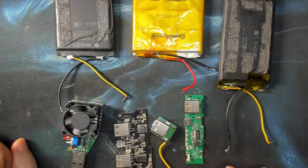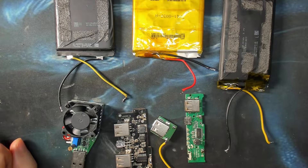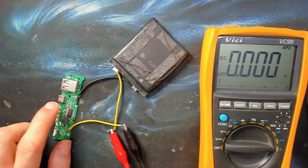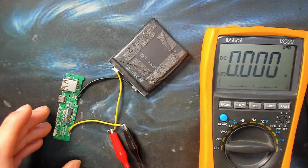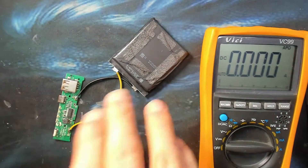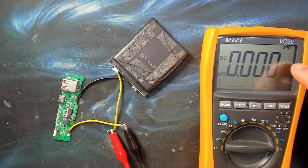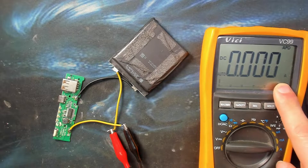This is interesting because it tells you about how long power banks can hold power, and how some of them will just drain their battery with nothing connected, but some don't. I've got a decent power bank controller board here which I'm planning to use in an upcoming project. I selected this one because I wanted to find the one with a very low quiescent current or a very good standby mode. Notice the whole thing is in complete shutoff - it's all connected but in shutoff, and there is zero current being drawn from the battery. We're looking at milliamps here and we're down in the microamps, which is absolutely nothing.